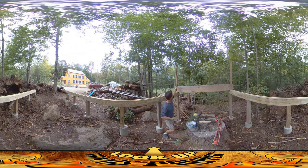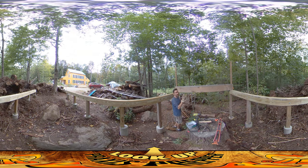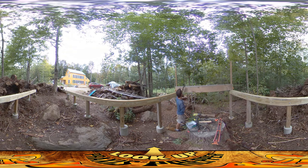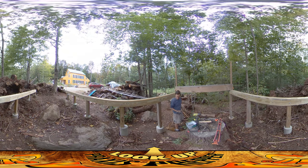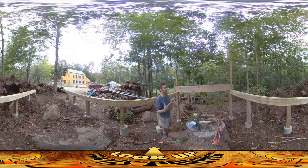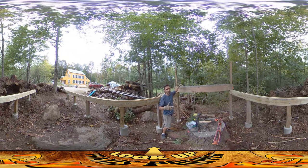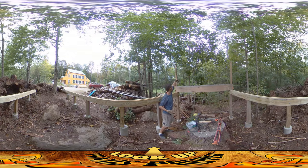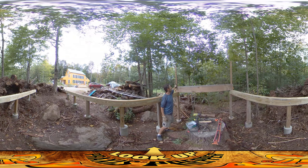As you can see, there are posts coming up out of the ends of this floor joist. This floor joist is similar in concept — two 2x6s with a gap, and this one is two 2x10s with a gap in the middle. These posts are stuck into that gap. These are not final posts — they're temporary. The final post is going to be made out of three 2x4s nailed together, with the middle 2x4 extending down into that gap, the same way it was done in the house.